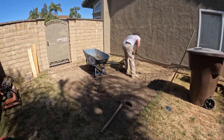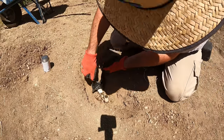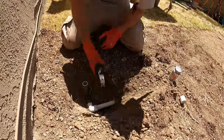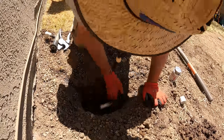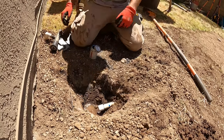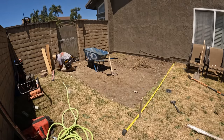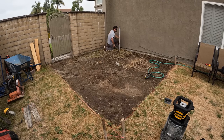On his first day he arrived here, he's just going to remove all the grass and he's capping some sprinkler heads. Now with that blue Christy's hot glue, you don't really need a primer because that stuff doesn't require it. I mean it's a nice bonus if you use it but it's not really necessary. Typically I'll use the primer if I'm working with a pipe that's under constant pressure, or if it's really old pipe that needs a lot of cleaning.